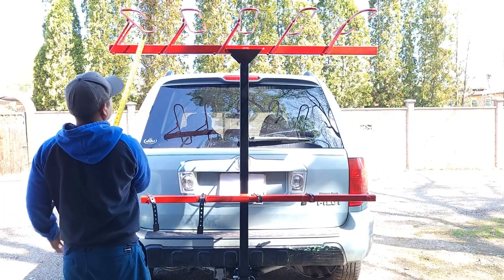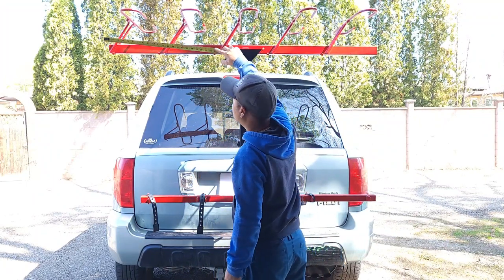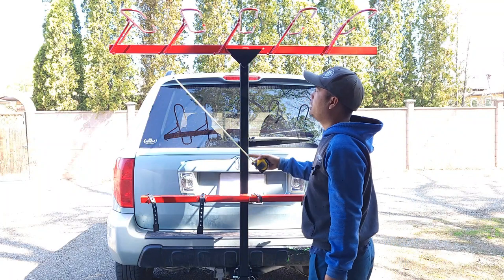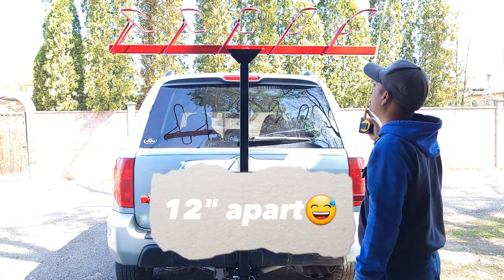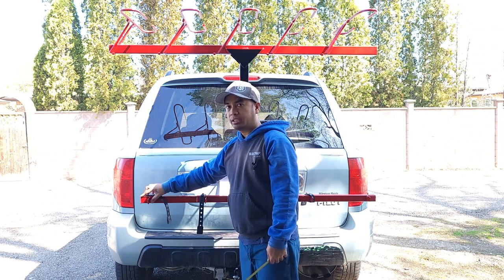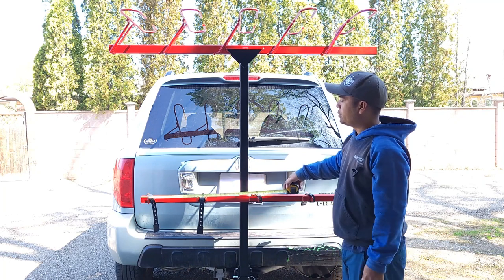The height is 5 inches, so write that down. The gap between each hoop is 12 inches — that's 1 foot. I mark from 1 foot, another 1 foot, 1 foot, and so on. Once you set the 30-degree angle all your hoops will line up at 12-inch spacing. At the bottom where your tire sits, I add 2-by-2 angle cuts welded in at 1-inch pieces so your tire has a good grip and won't be bouncing around. Same 12-inch, 1-foot spacing applies.